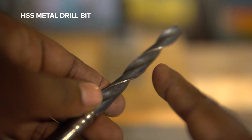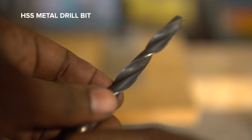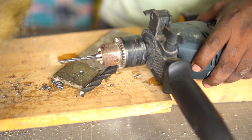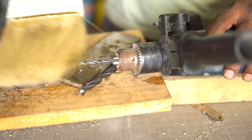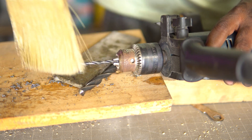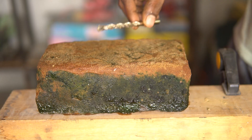The edges of metal drill bits are way sharper and it is important that this sharpness is maintained well. Hence, I would recommend using pure cutting oil and not the one that is mixed with water. Also, it's a good practice to clean the bits before storage.